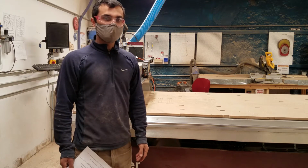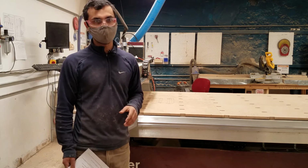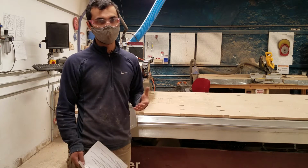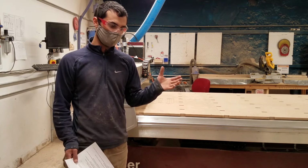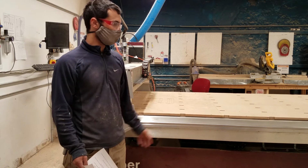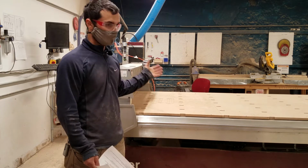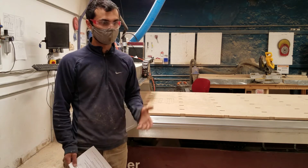In terms of the materials that you can use, you can cut wood and foam, leather, rubber, all sorts of cool things. We ask you not to cut carbon fiber because it makes a pretty nasty dust, and also no metal. The reason for that is if you've seen a metal CNC, it's entirely enclosed because it's throwing hot metal chips. Pieces of metal can go flying, broken end mills, and none of that is here. This is not enclosed. Someone could just be walking by, minding their own business, and get whacked with a piece of metal. So that's an unacceptable risk. In addition, there's the coolant that would be spraying and other factors that make this machine not really suitable for metal in this environment.